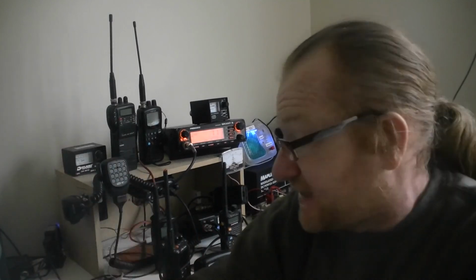So that's actually quite easy for me to remember. As long as the CTCSS is transmitted when you're transmitting, you will open the repeater. If you don't have the appropriate CTCSS, chances are the repeater won't work, and you'll be wondering why. And then obviously it's just a small issue of turning on CTCSS. And don't forget the repeater shift.